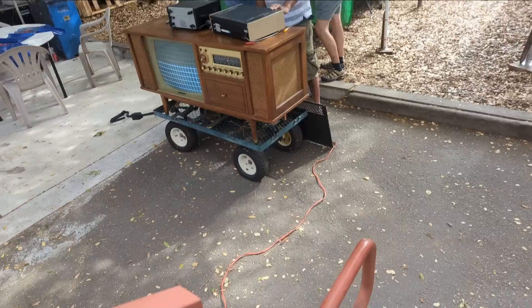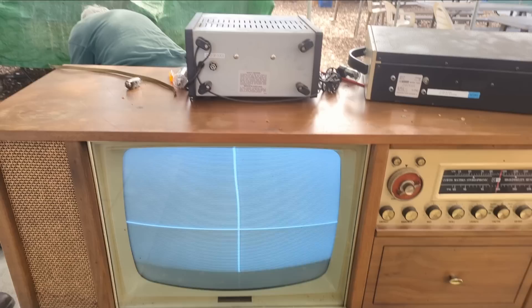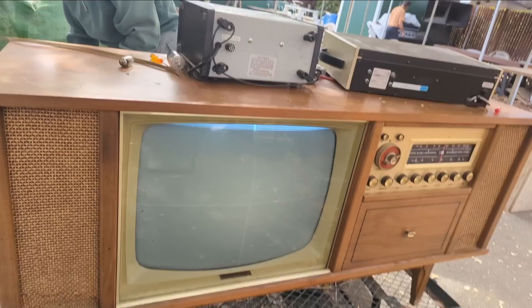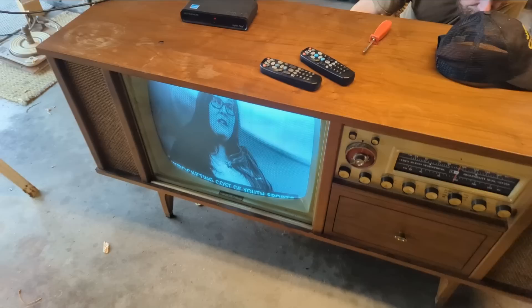It's not quite filling up the screen. We did the math and we were missing a 5k resistor — it had opened up. Now we have a good solid CRT. I know this is not showing up on video, but it seems to be working pretty good.